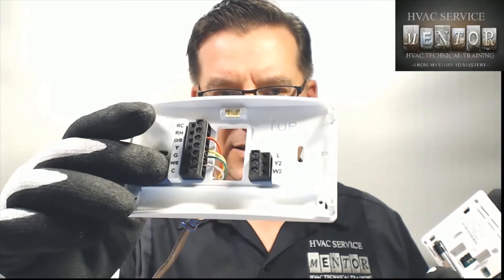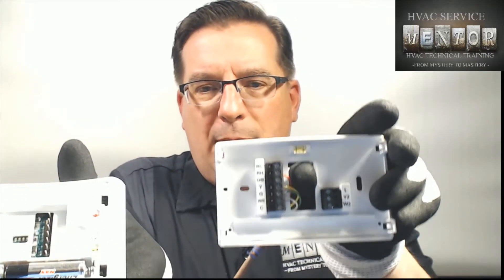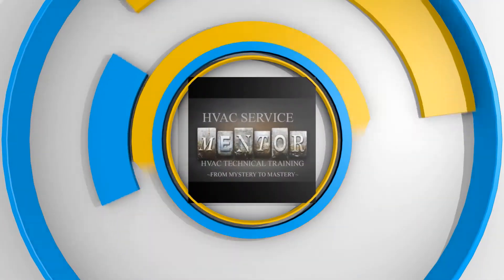So I've got some wires connected to the thermostat and a multimeter connected to the wires. I'm going to change the camera angle and show you how we'll do this using a short section of wire — otherwise it's going to be exactly the same. When you do yours, you might have the sub base disconnected from the main thermostat — totally fine. But I want to caution you: it can be a little tricky identifying which pin is associated with which terminal, because when you pop it off the wall and turn it around it's a mirror image — it's going to be backwards. Once you figure that out you're off to the races. This one happens to have all the pins labeled on the board; not all of them do that.